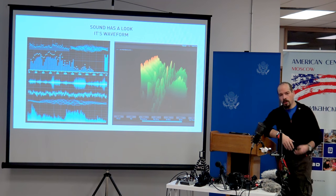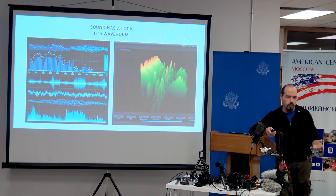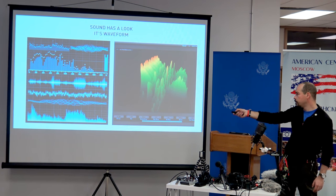On frequencies, as you may remember from school biology or physics, human sound perception is from 20 hertz to 20 kilohertz, from 20 to 20,000. That's an ideal situation. Of course, there are people who can perceive sound maybe even higher than 20 kilohertz. But mostly, human speech is between 150 hertz and maybe, for very high voices, 1 kilohertz. That's exceptional, like falsetto or whatever. So human speech is in the range of about several hundred hertz. It's called the middle. So that's the human voice range.